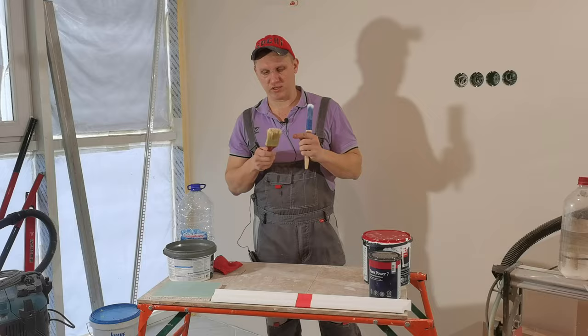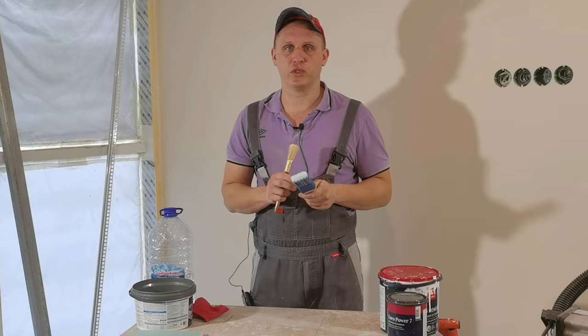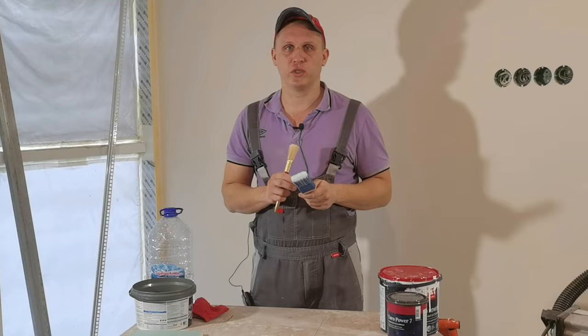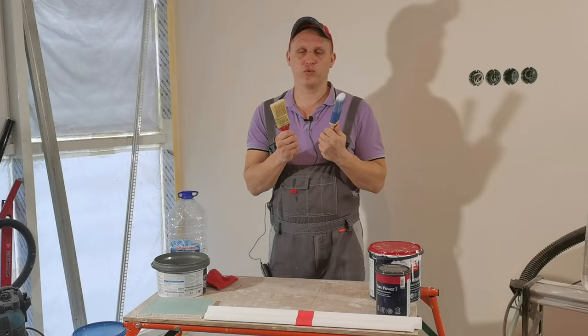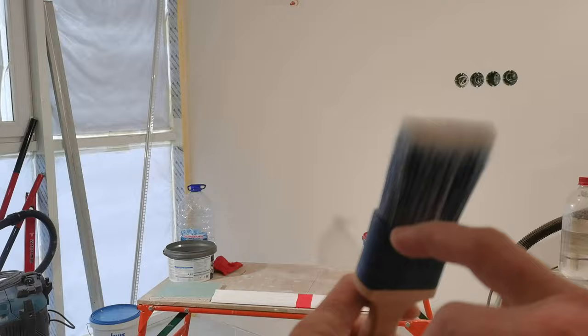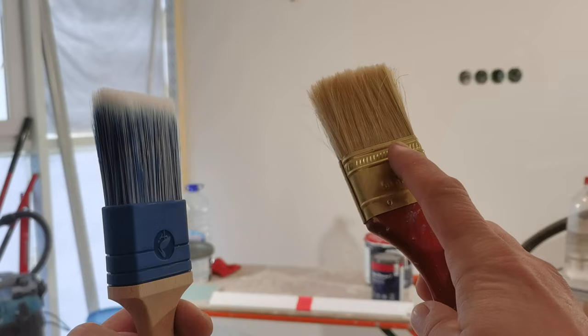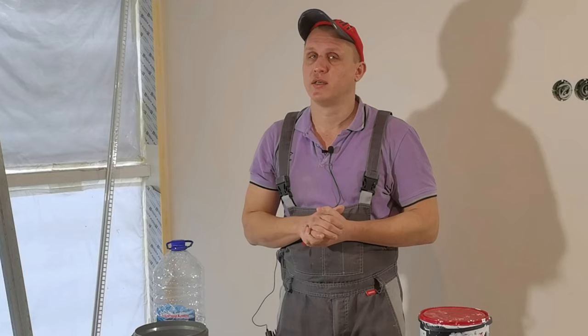The second important thing is the choice of brush. This cheaper brush is not bad in principle, but for finish painting of the plinth it will not work. Here is a brush from a German company — this one costs around 100 rubles, while this quality brush cost 560 rubles at the start of 2022. What is the difference? Look how the handle is designed on the quality brush — the paint does not flow down. With the cheaper brush there are constantly leaks. Also look how thick and dense the bristles are on the quality brush — this gives a more uniform, streak-free finish. So two basic elements: good paint and a good brush.